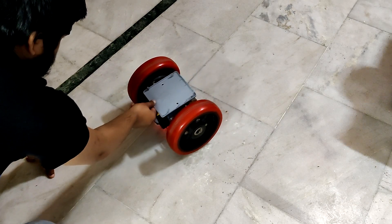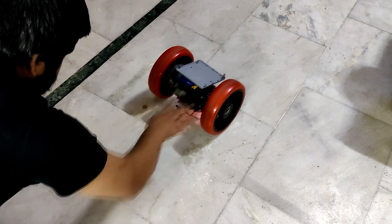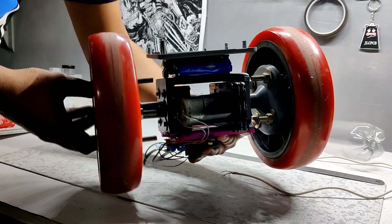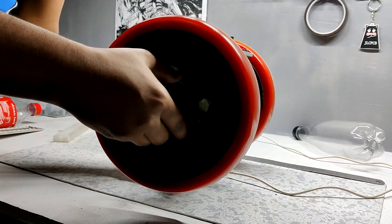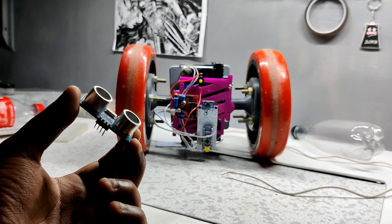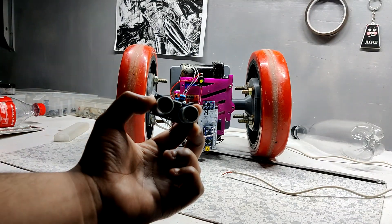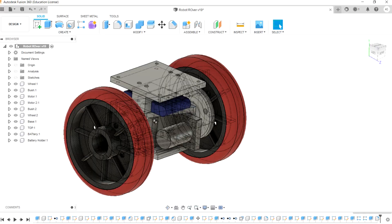As you can see, the self-balancing part of this robot is working properly. However, it still requires a lot of changes, including getting rid of unnecessary movement in the wheels when the motor is at a stationary position, and increasing the robot height by adding the upper level with threaded rods. An ultrasonic sensor can also be added to avoid obstacles like walls while balancing. These improvements are planned for part 2, so stay tuned.